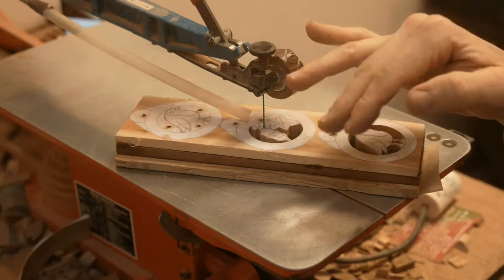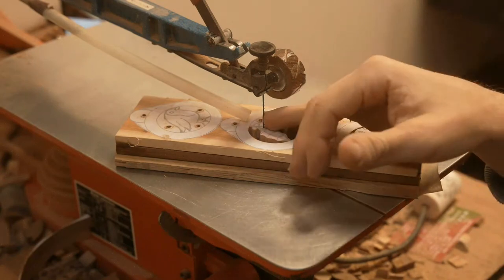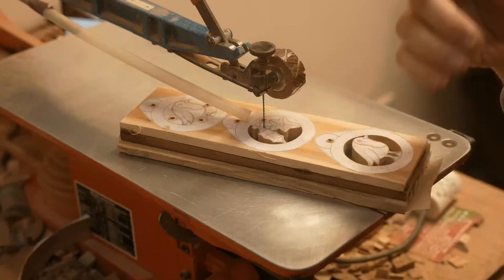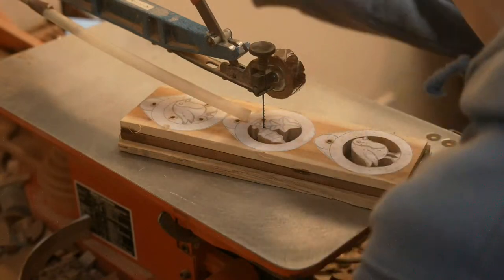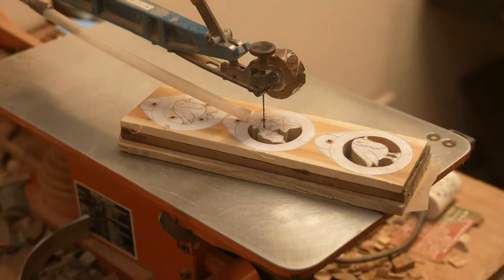You've got to have the right blade. This is explaining in the workshop and in the live stream at the same time that the right blade selection is really important. So we're using the Niqua Pebeco or the Niqua Speed number 9. And then the other thing, using things like packing tape on the bottom layer lubricates the blade, making the whole process that much easier. Do you use the same blade for all woods?